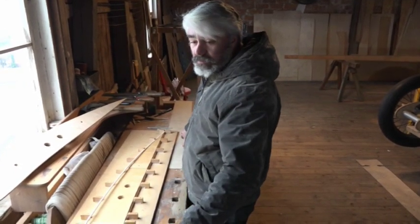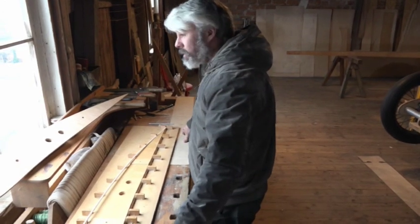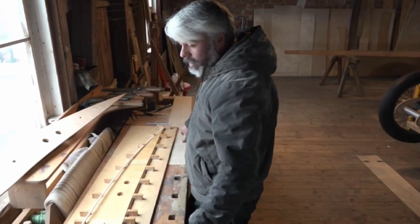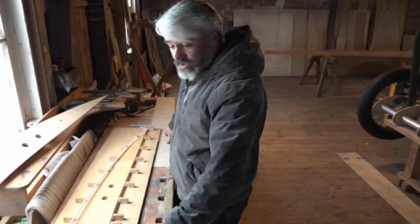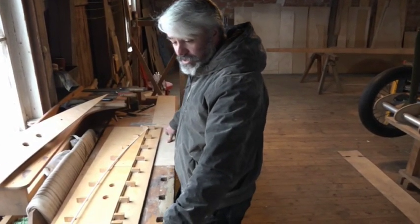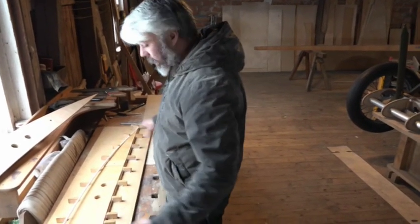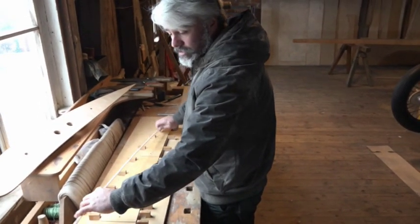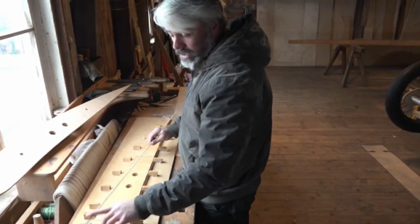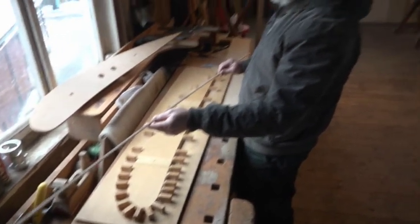With small wooden stringers up to a cross section of 10x10 mm, you can work with just the heat. You can make a complicated device which makes sure that the heat is brought into the wood from all sides, or you can go the simple way and use an old hot plate with a round piece of steel on top of it. I've marked the position where I want to pre-bend the wood.